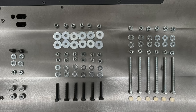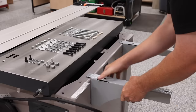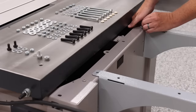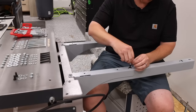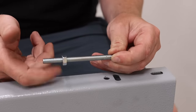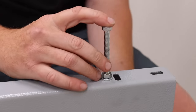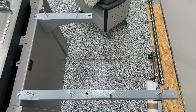I finally got started on the assembly of the support tables for the table saw. I recommend laying out all of the hardware that will be needed for this task, as it will be very beneficial in the assembly process. The first pieces to install were the two support arms that provide support to the full-length table. These are secured by pre-cut slots on the bottom and then a nut and bolt at the top. From there, I was able to add the support arm extension that will support the smaller support table. I then began installing the posts that the support table will rest on, leaving about three inches total above the supports to help speed up the adjustments needed later to level everything. There are a total of six of these posts.